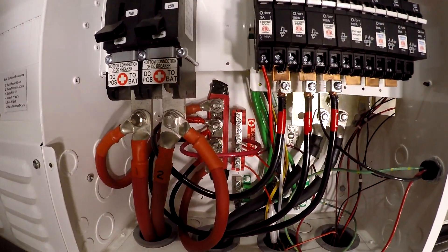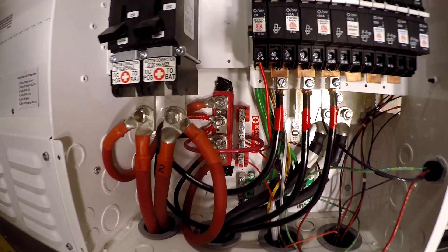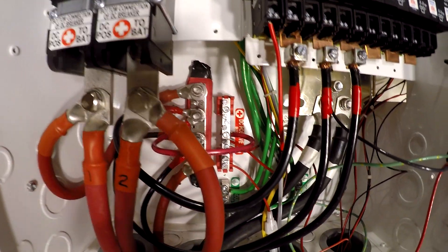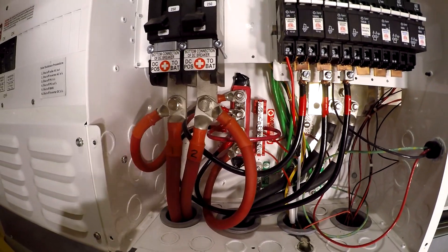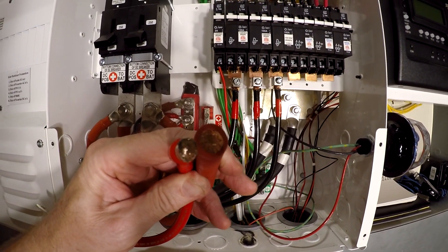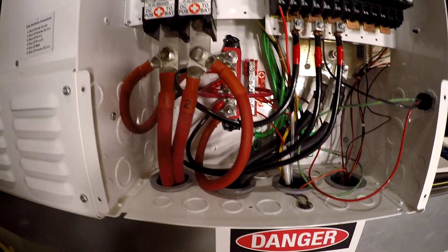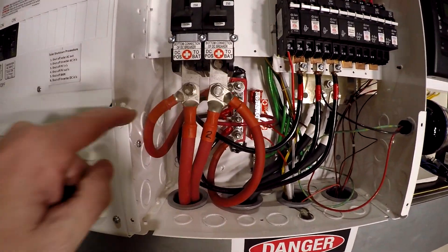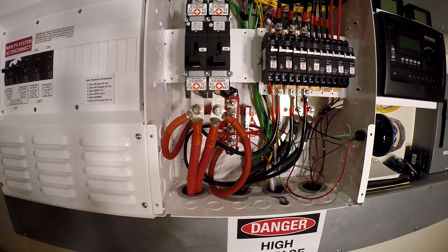A couple hours later and I've got the terminal block in there. I've rewired the three strings with lugs on them. I kept the old terminal and jumped over to it for the little stuff. But now I've got two big 1-0 cables for all the power. So basically I went from the one on the left here — one of those — to two of the wires on the right. So quite a bit more wire there. So hopefully that will do it. It is a little bit different, so I'll have to see if that creates any kind of a problem — actually it should be better. But we'll see.